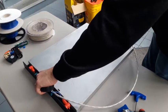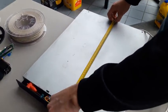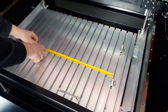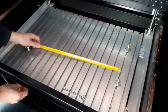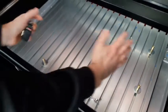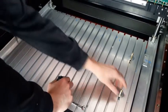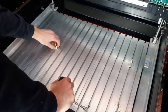The first holes are 10 millimeters in, and we're looking at 440 millimeters — 44 centimeters — between the holes. These slots are on 40 millimeter spacings, so you can see that this is where our other standoff needs to go. Some hotbeds may be larger or smaller, and you may orient them at a right angle the way this one is.